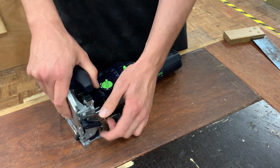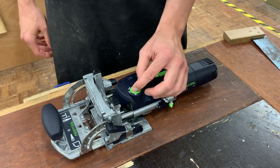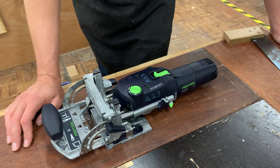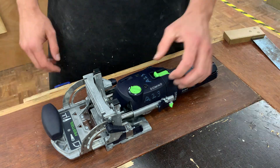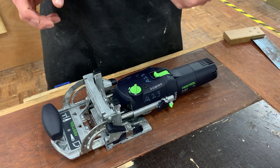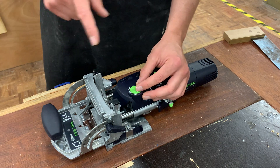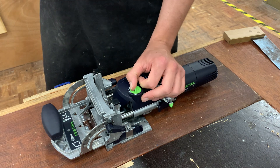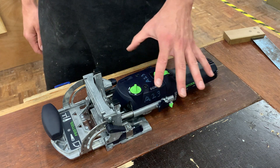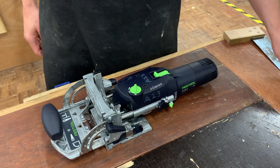We do have one last feature, and it's one we don't use here in school because we just rely on you to do a good job the first time. This feature up here changes the width of the cut. Dominoes are a set size, so we keep it on the tightest setting because we want everything to line up and be intentional. If you're just off and make an error, we can use wider settings to give you a wider cut, but that makes the joint less stable — and we don't want that. So be accurate with your marking up, be intentional, be safe with the domino, and always ensure — as with all tools — please get permission before using. I'll see you guys in the next video.